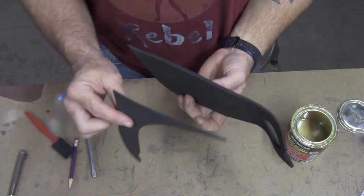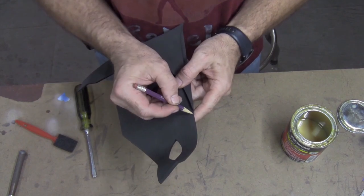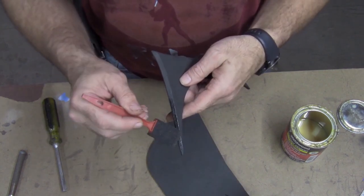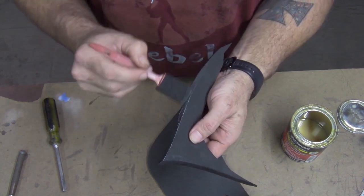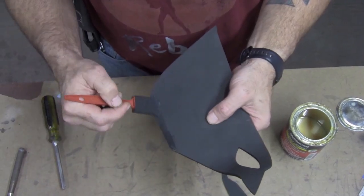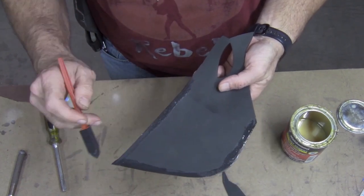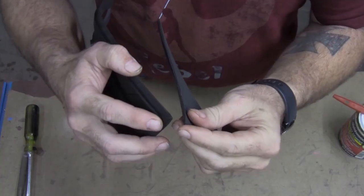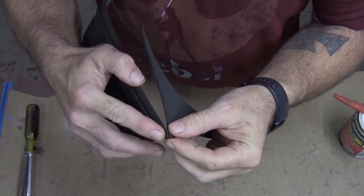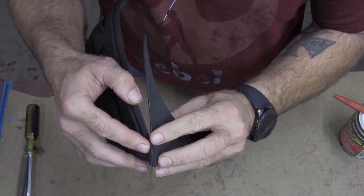Next, you can line up the top edges of your pieces and make a reference mark at the front of your inside side piece. Now apply glue to the beveled edge on the back and top and to the flat bottom edge. On the outside earpiece, apply glue to the inside surface area along the bottom, back, and top edge. You can stop at your reference mark. Glue your top edges together starting at the back point and working your way to the front.